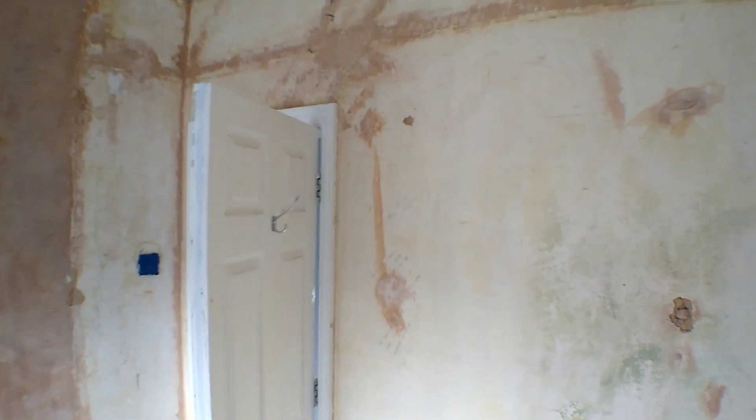It was covered with a lining paper. We've got a product here called fiberglass reinforcing mesh, which comes in very handy if you've got lath and plaster surfaces like this. You can even use it on lath and plaster ceilings, as long as your ceiling is in sound condition and the keys haven't blown. How do you know if they've blown? Go into your loft, lift up the insulation, and you'll see the keys on the back of the laths. If they're overall okay, no signs of sagging, and the plaster hasn't blown away from the laths, then we can embed some fiberglass mesh in the skim coats and re-skim the ceilings.